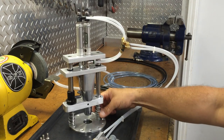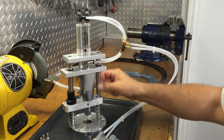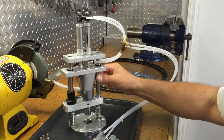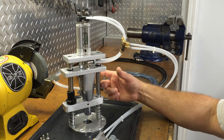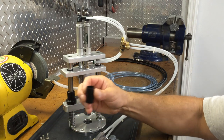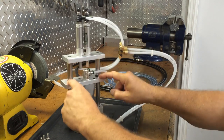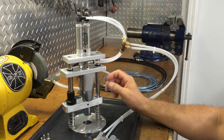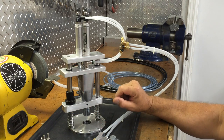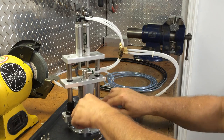As you can see, I just have two small springs here at the bottom. Just cheapy springs from a local hardware store that fit over the 5/8. This is 17-4 stainless. I had a stick of it in the shed. I used that. All I did was polish it a little bit to make it smooth. It was pretty smooth, but just from sitting around, it got a little cruddy. I have a piece of this Delrin in these two holes here. The holes are 3/4 inch and these are 5/8. This piece was already on this piece of aluminum I had, so I'm just using it for now. I think I want to switch over to bronze bushings. It runs pretty smooth, but I can feel a little bit of drag.